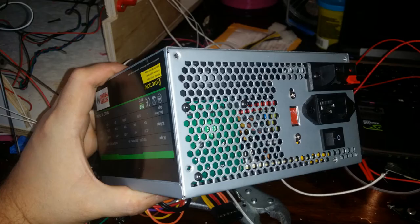What that usually entails is a relay connected to 12 volts to switch it on and off, and 120 volts connected to your mains and then out to the silicon pad. I didn't really like that — it seemed a little unsafe to have just raw 120 volts running to the back of the 3D printer. So I wanted to close that off as much as possible. What made sense to me was: there's already 120 volts going into the power supply, so why not integrate the relay into the power supply? So that's what I did.